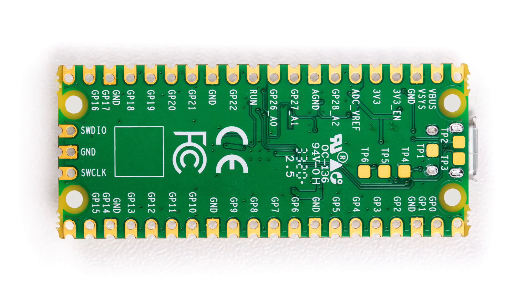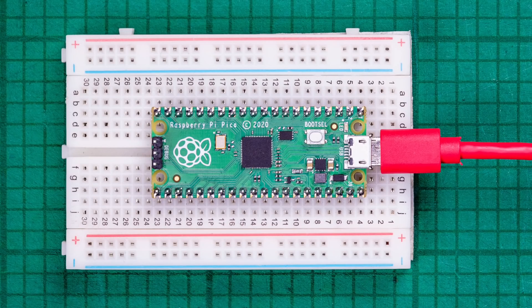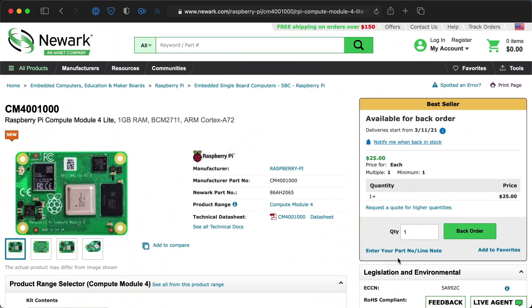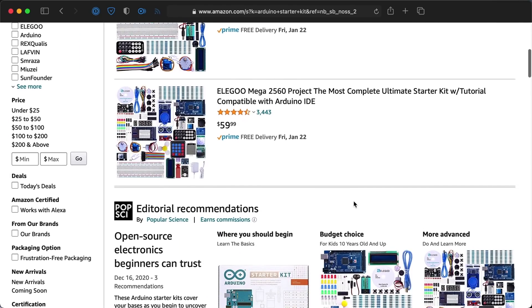One thing I don't like about the Pico's design is the lack of pin labels on the top of the device. They're all labeled nicely on the bottom, but only pins 1, 2, and 39 are labeled on top — there's no way to see which pin is which when it's plugged into a breadboard. It would be nice if the Pi Foundation could silkscreen labels on top, maybe like the Teensy does with little angled labels. Other than that, there's not much wrong with the Pico for its price. Having two cores may be nice for some projects, but most of my own work wouldn't benefit from the complexity of multiple threads. All in all, I think the Pi Foundation has a winner with their new $4 microcontroller, and I can't wait to see what other people build with the RP2040 chip. I just hope they can keep up with demand — it'd be sad if they're hard to find months after launch, like the Compute Module 4. I'd also love to see a full Getting Started kit with lots of different components like you can find for the Arduino.